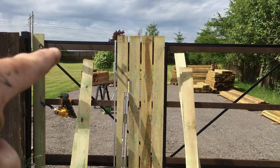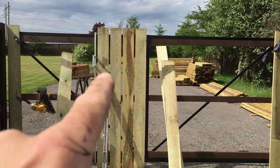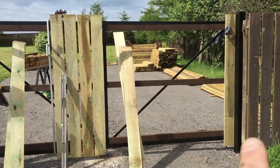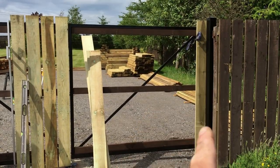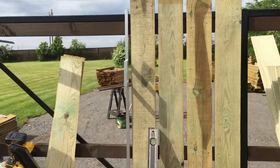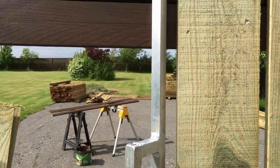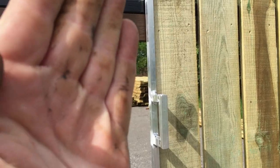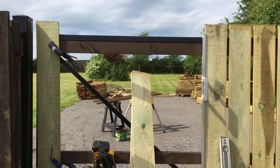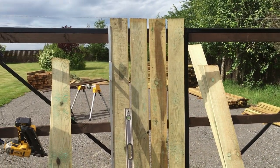On the outside of the gate I've strung a line along the top and I'm just following that line with the boards. I'm boarding out from the center — any rip cuts needed will be in the corner where they won't be seen. I'm just using a 20mm spacer — a homemade aluminium spacer I use for fencing, just a bit of aluminium box section. Butt it up, put the slat against it, nail it, and that's it, all the way along.